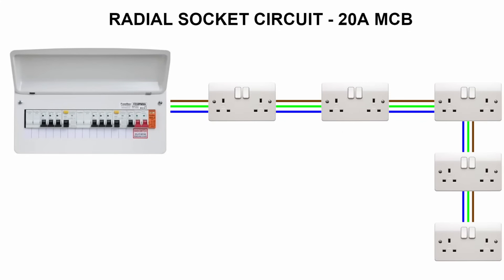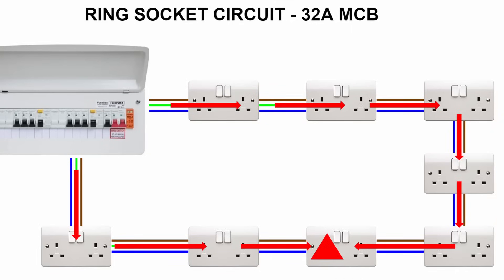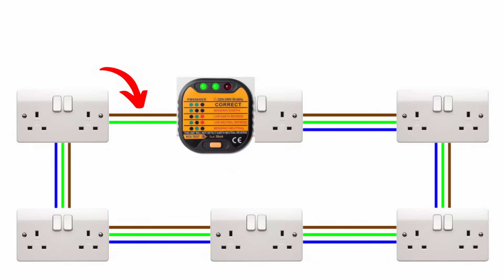That's on a radial. If it's a ring circuit you've got current coming from both directions — it's not just a daisy chain, it's connected in two places back to the consumer unit. So if you've got a core not connected correctly in the back of the socket or just hanging out the back, this will show everything as normal still. You could have a broken ring and this wouldn't show you the issue at all — everything would appear correct on this.